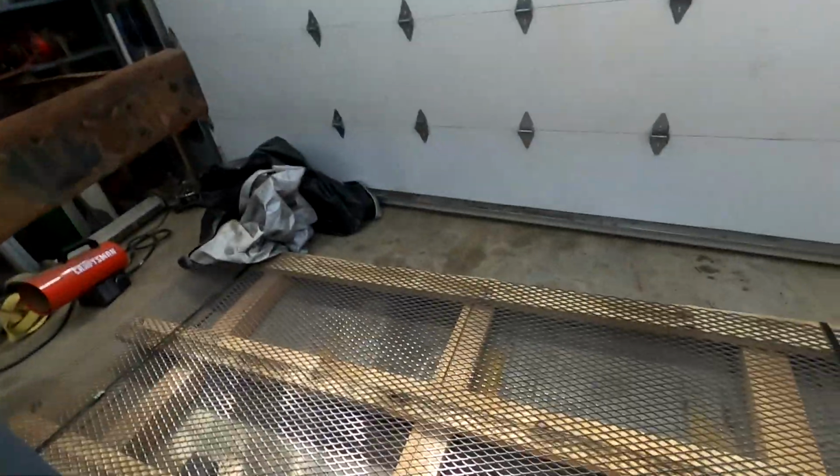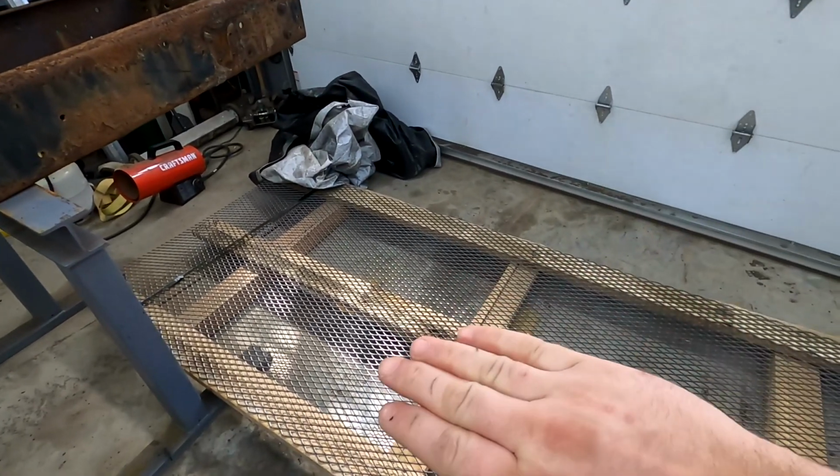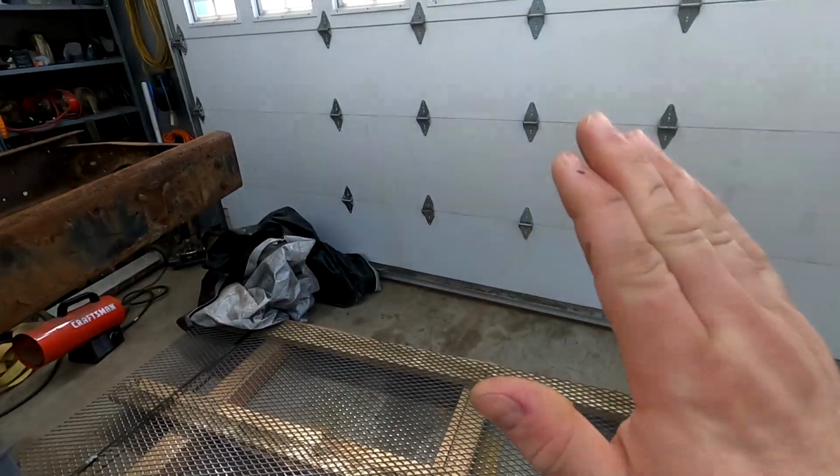Recently he got some springs added on the back of his truck, which raised the truck up a little bit and threw off the angle of the ramp. So instead of a nice angle, it was more tilted. He actually flipped his stand-on unit over because he was backing it down and it was too steep. So this time we're taking this mesh and we're going to cut it appropriately and make a longer ramp, so when he backs down it's not as steep and he doesn't risk it getting top heavy on the front.